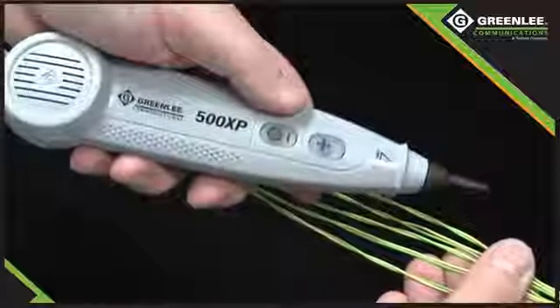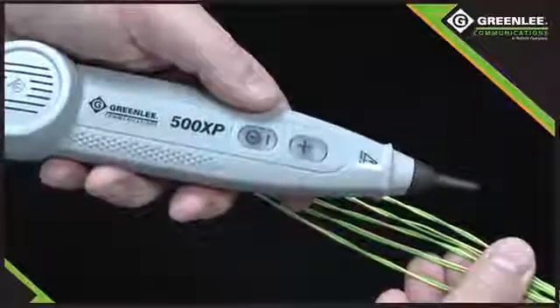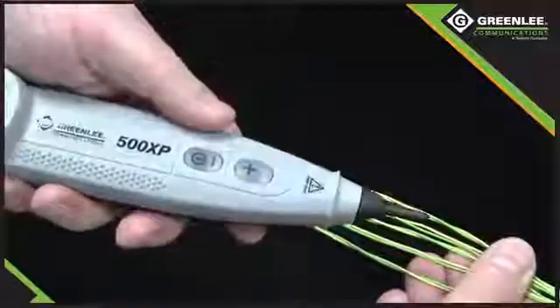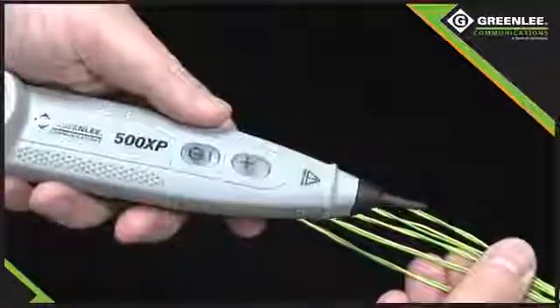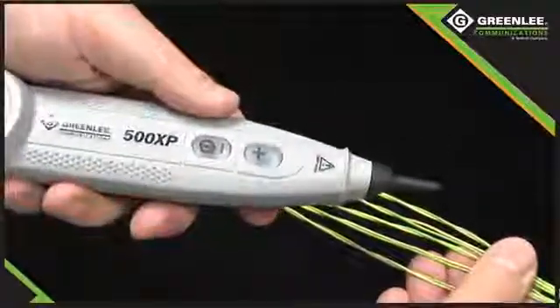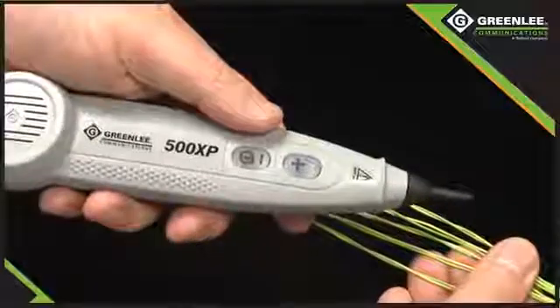We have five pairs here: one carrying potentially dangerous power, perhaps as a result of a power cross which results in lots of power influence hum; another is carrying a noisy data signal that causes significant audio band interference; another is quiet; and the last two carry distinct tracing tones — one from an NC100 and the other from a 77GX.